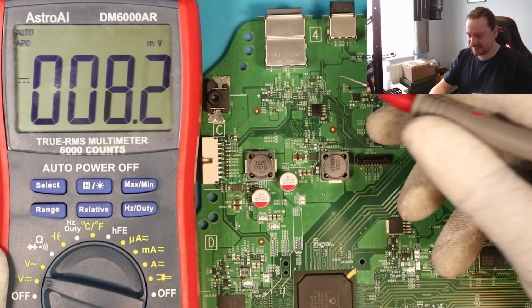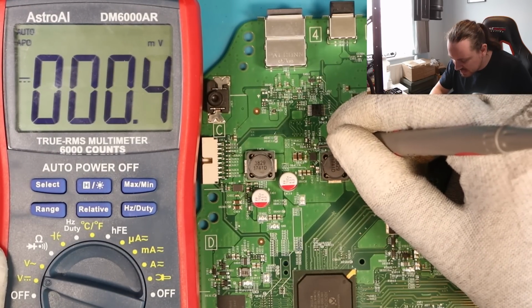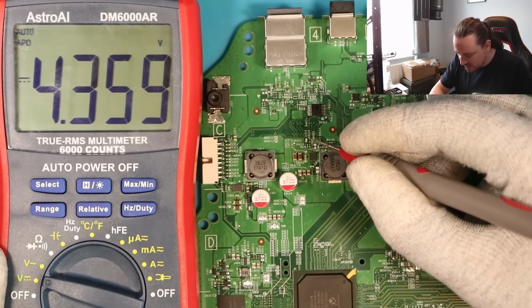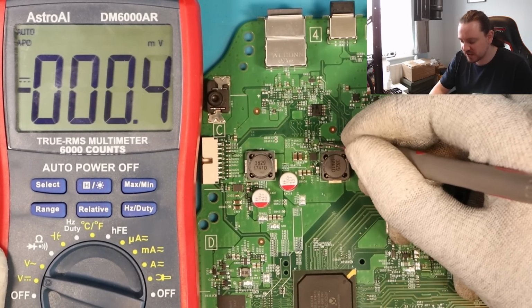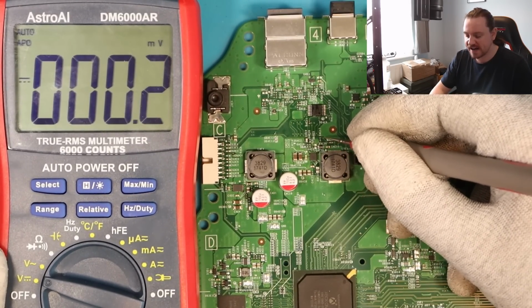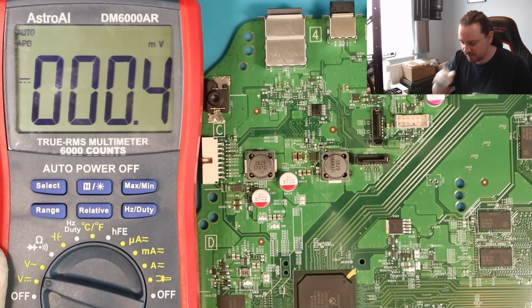I know you guys are struggling to see at the moment. However, that's really, really good. That's coming from the chip. Okay, so what about the test pad? That's showing ground because there's nothing connecting the test pad now because we removed that cap. So let me replace the capacitor and maybe this is fixed.